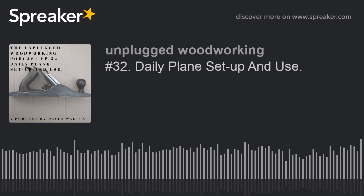So, face planing. When I face plane, and I think a lot of people do this, they'll actually skew the plane. So if you can imagine, if you're planing a piece of wood and you have your plane dead square in the center of your board, and it's dead straight, to me, for this example, that would be 90 degrees. Okay, so when I skew it, I tend to skew it maybe 70 degrees, something like that. I've never actually measured this, so I don't really know the degrees. This is just visual, sort of by eye.